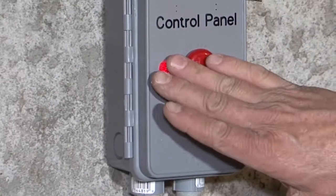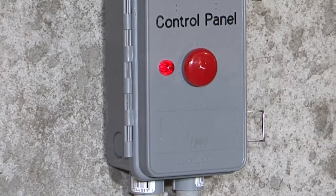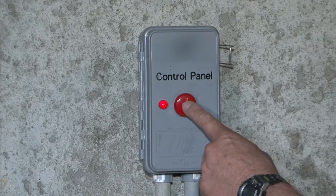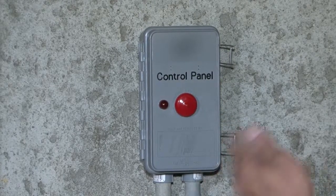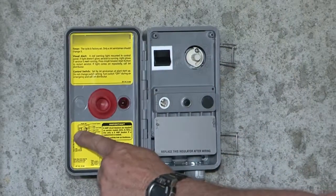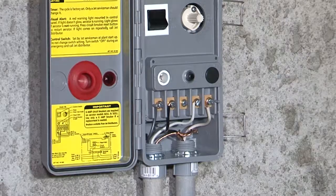I'm in the house now, ready to get power to the unit. When that red light is on, it means the aerator is not working — it doesn't mean it's working fine. I'm going to reset this circuit breaker so I now have power going through the timer and out to the aerator. If you don't know anything about electric, don't mess with it — have somebody else do it.